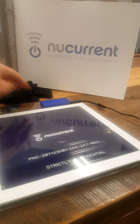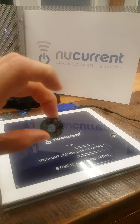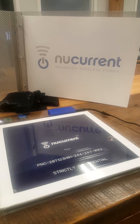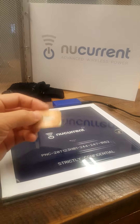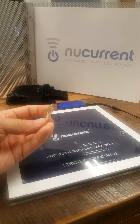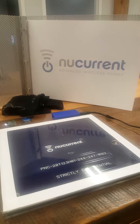Inside of the blue box is a 5 watt transmitter design that we've done in-house in a 26 millimeter diameter puck, pairing to a receiver coil embedded in the compression socks that is 0.1 millimeters thick, as well as the ability to maintain flexibility without jeopardizing efficiency.